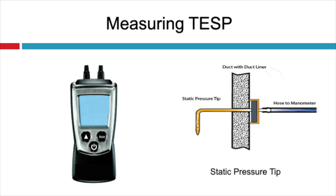When inspecting ducts on a system replacement that's still operational, verifying duct static and measuring the volume of air or CFM is the simplest way to understand the current situation. For measuring static pressure, it's one of the easiest ways to know if you have too much airflow or undersized ducts based on total external static pressure of the existing duct system. This procedure should be completed on every maintenance, no-AC or heat calls, and new startups. By verifying the static pressure is close to design and monitoring system static during site visits, you can see things like A-coils becoming restricted even though they're buried in the plenum. Understanding where to make the correct measurement and using an accurate digital manometer is the key to this first step.